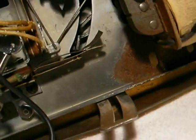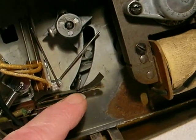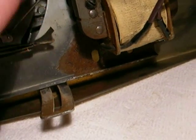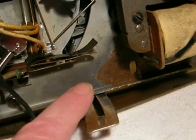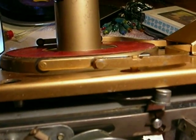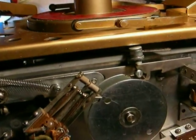As it's holding it in, the turntable is going around and dropping records like normal. It's going through its cycle. This switch here is going to pulse with every cycle of the turntable — each time it goes around and drops a record, it's going to pulse this switch. It's going to step up the stepper unit. When the stepper gets to where it's supposed to be, it's going to pop out the selected button on the front, and it's going to release this relay to let the arm come into play. And then the whole cycle will start all over again.